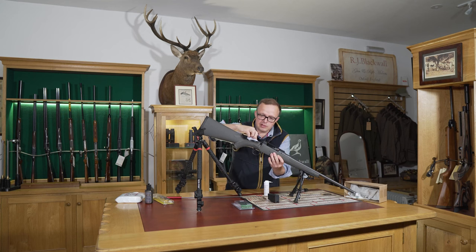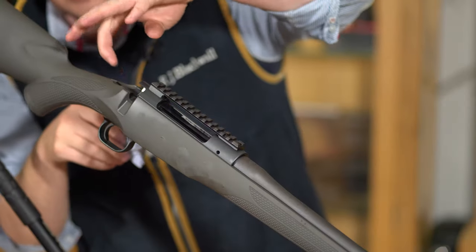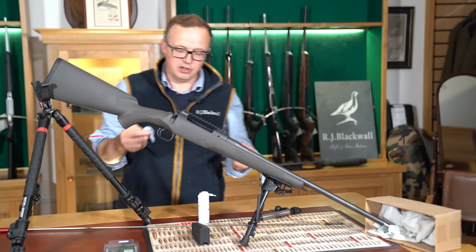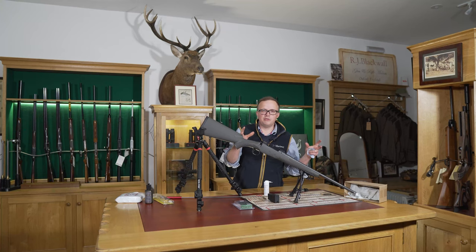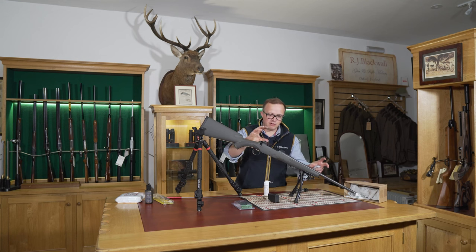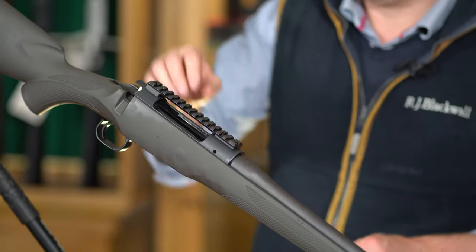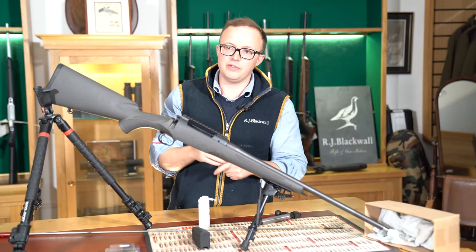It's metal with moving components, so a gentle film of oil is good. You can get little brushes to work into various places and scrape any muck gathered there. In a dusty or sandy environment, spend time getting grit out of your action — you don't want it binding up, especially if you're hunting something potentially dangerous. If the rifle is having real issues, get it to your local gunsmith to have it properly stripped down, the trigger mechanism removed, the barrel taken out, and properly washed out without damaging your stock. It's also worth checking your mounts, bases and rings for movement, as vibration from shooting can cause issues over time.